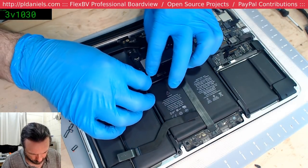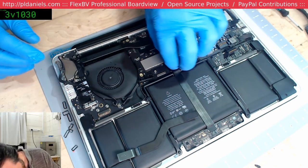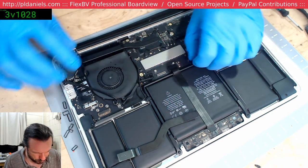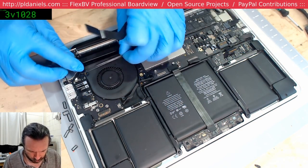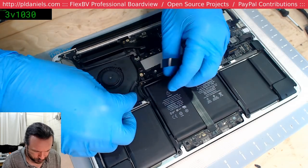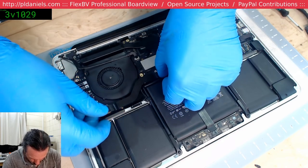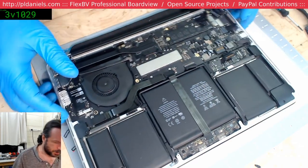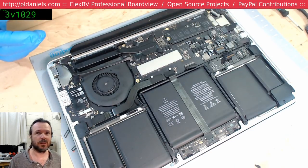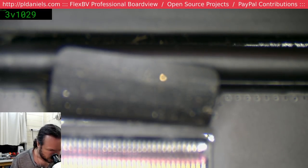Yeah, I just want to confirm that this machine will now run without slowing down considerably, because that was the real problem originally. And where you get tricked on this is that these boards inherently do not tend to run the fan until quite late, like when they get up past 80 centigrade and whatnot. So when you put them back together and boot them up, they boot, but they don't spin the fan. It doesn't really make you go, oh no, there's something wrong. You just think, oh yeah, it's the usual sort of thing. It isn't up to 80. So of course they're not going to spin, but it works, so we're all good. It's not wrong, in this case, anyway.